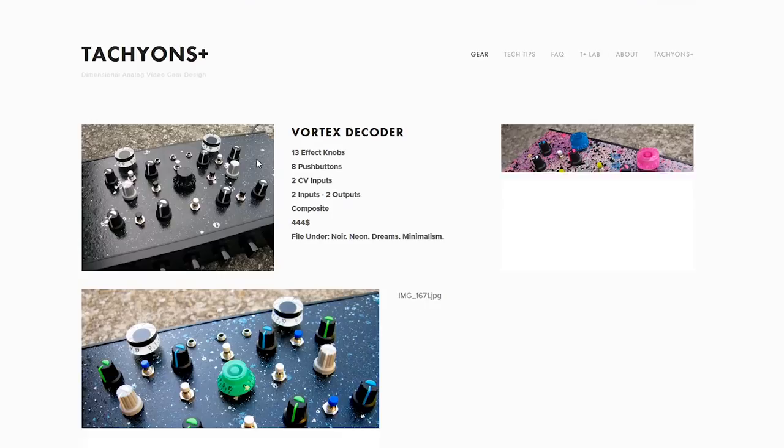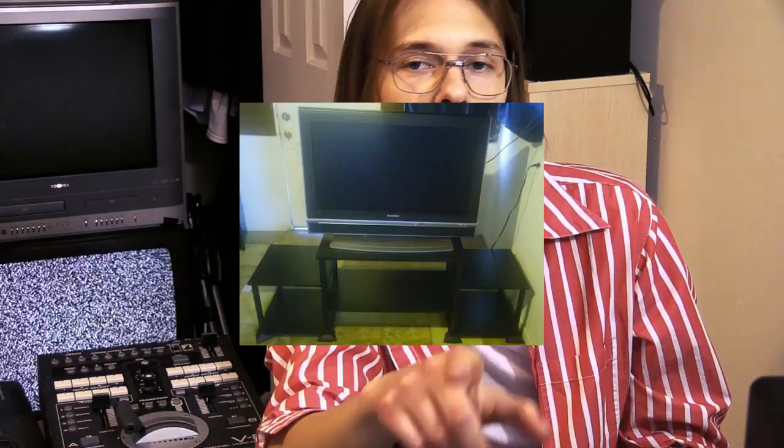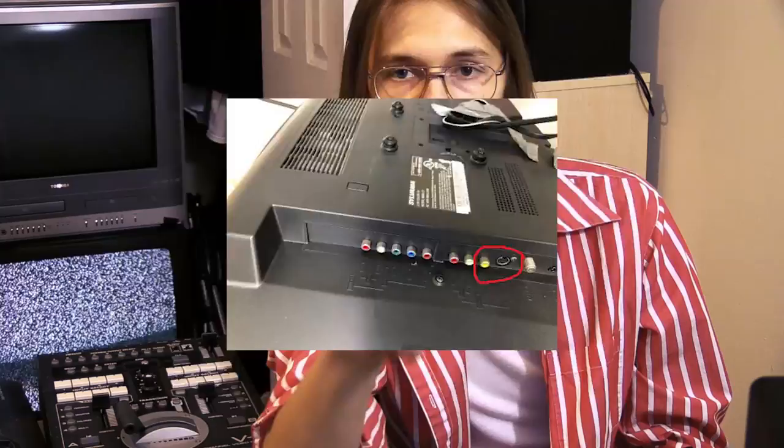I'll put his YouTube link in the description. And of course he makes his circuit bent stuff, which is really good. Also, sort of like a technique and a half — you don't have to use a tube TV to film off of. I grew up with LCD screens, those big flat screens, and those work too, because anything that has an analog input, whether it's RCA, composite video, or S-video, is going to work. You just have to point the camera at it, center it, frame it, make sure it looks like the screen's not even there, and you can make it work. I've pointed a camera at a flat screen and captured it.